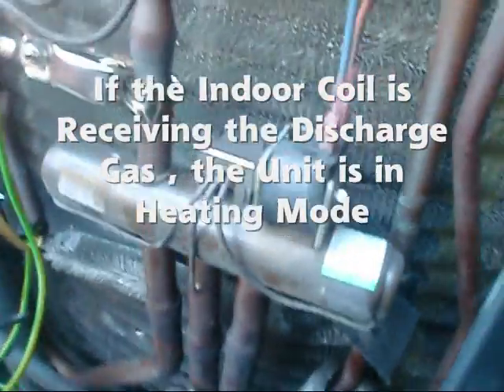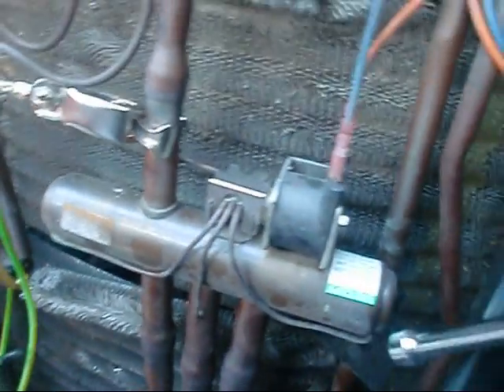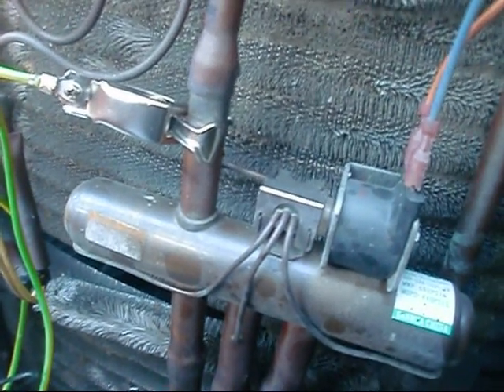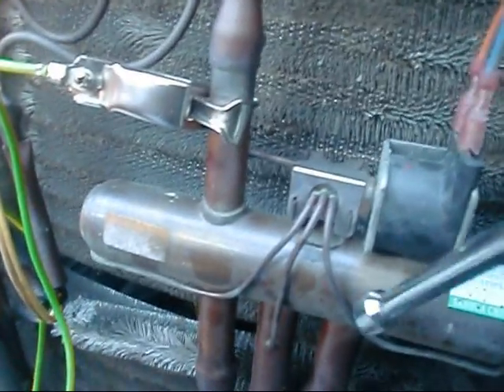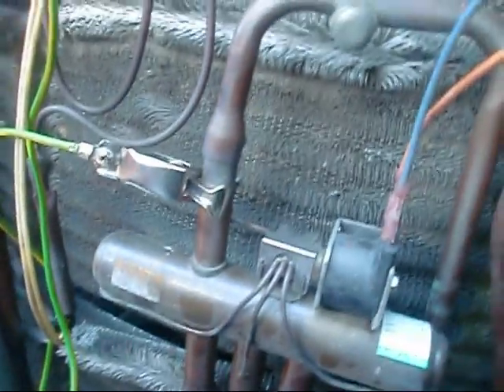With these little pilot tubes here, this high-pressure gas — once it's told from the thermostat what mode you want to be in — it'll actually send a high-temperature gas to either the left side or the right side, and that's what actually moves that little cylinder in here to open up one of these ports to the other.